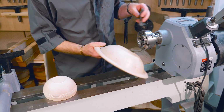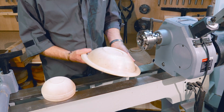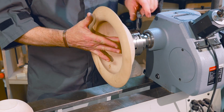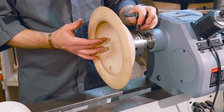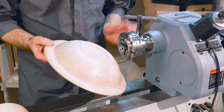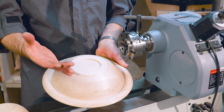Got our dovetail on here, got our bowl, we've got our key, have a dovetail outer shape. So as we expand into that recess, so the bowl comes up, goes in, lock it in, we turn the key nice and gently, fingertip, tighten it up. That's going to hold it nice and securely. It's a good size. Take it back. We can have our shape so it blends in. Nice wide foot. That's quite important.